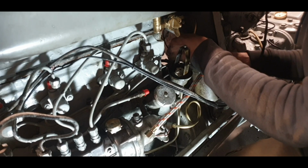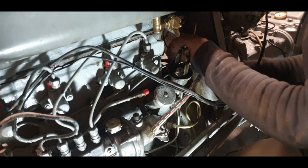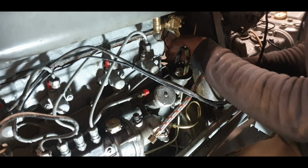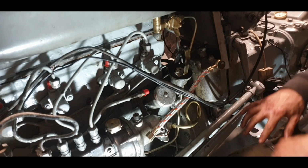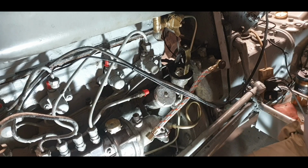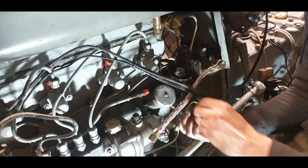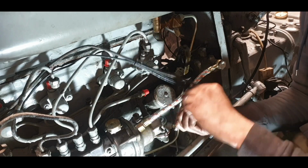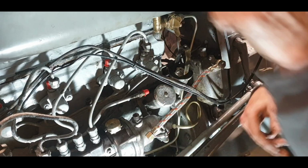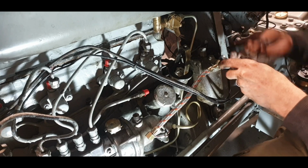This is starting to get a little bit of grip on things now. When I get this tight, I tighten up the fuel filter. Okay, that's tight, so we can tighten up the fuel filter now. No, I can't. I want to do this connection here first. These are all metric 13mm, seems to fit best. And then finally, when I have both ends of the pipe done, that's when I hit the fuel filter again with a final nipping.